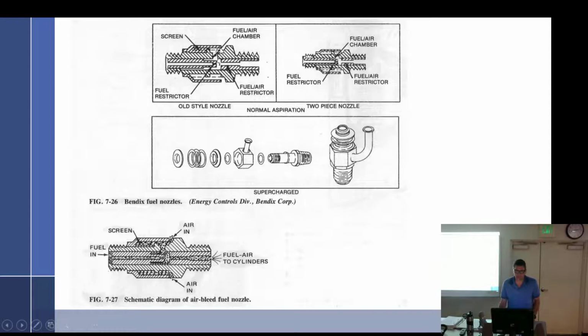But ambient air is around that, and ambient air is drawn in through the manifold because the manifold pressure is below ambient. So that's the one way in, right? But what if we turbocharge or supercharge? Then this spot right here is higher than ambient pressure. So you will not suck air in, because everything is at a higher pressure. And so it tends to want to go backwards.